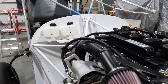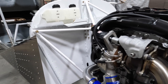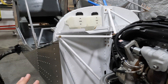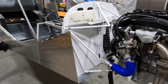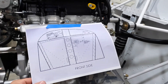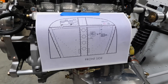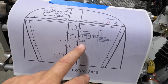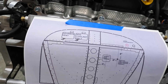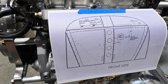Next thing we're working on — I've been working with Viking, they've got great documentation on their website. One thing I suggested to them was, you've got the Viking 195 on a super duty, why not do a firewall-forward systems layout? So I sent them a screenshot of the print and we now have a firewall layout with recommended spots for the harness pass-through, throttle cable, positive/negative cables, and coolant and gearbox level overflow vents.